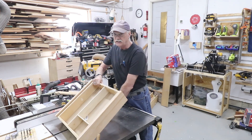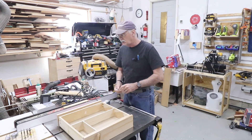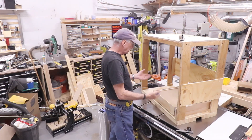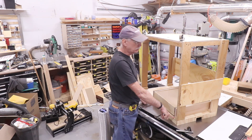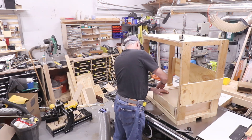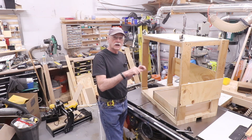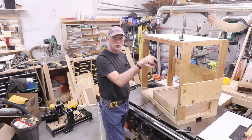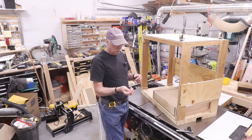It's not terribly heavy but it's cumbersome because it's weighted on one end heavier than the other. Heavy lifting done — it's upside down and ready to go. I've placed the drawer where I want it. It's a half inch proud from the front because there's going to be a half-inch drawer front on it that will hide the cleats and the drawer glides. I'm going to draw a line on each side to give me a datum so I can drill holes through the bottom that will be lined up perfectly with the cleats when I go to countersink from the other side.